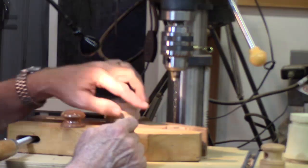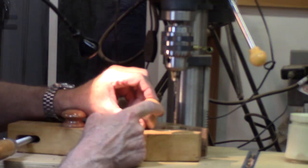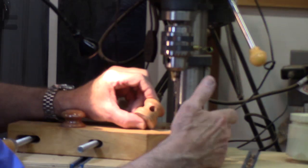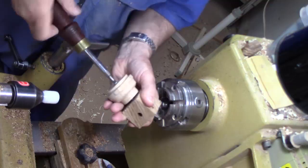I've drilled two 5/16 inch holes, and in the center one I'm going to drill a 9/64 hole for my screw chuck. Then on the side grain I'm going to drill a 3/8 inch through hole. I've found that you tend to get some blowout, so it pays to drill these holes on the blank first and then turn and sand them. Don't try to drill them afterwards — you'll mar the wood holding it and tend to get blowout.